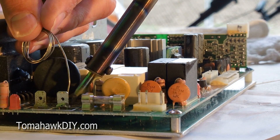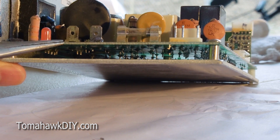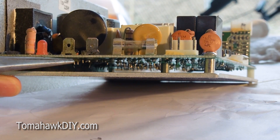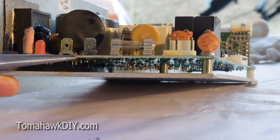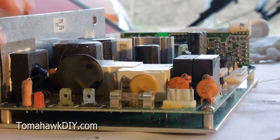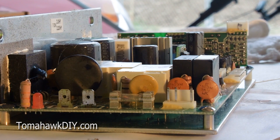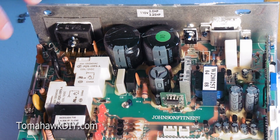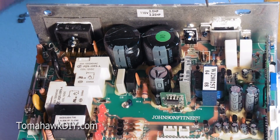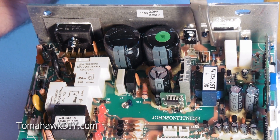I'm going to apply a little bit of solder on the back side as well. This is the one that we just put in — it looks like it's about the same height as the other one. I can see the pins; the pins can be seen sticking through the solder down here. So it would seem that we've made it through. I'll go ahead and see if I can do the same thing repairing the one down at this end, and then we'll test out the circuit board. Now that this has had a chance to cool down, it's feeling much more firm than before. So it looks like we've successfully attached it. Hopefully it's actually made the connections that it needs — given a gentle tug, it's certainly not feeling loose.